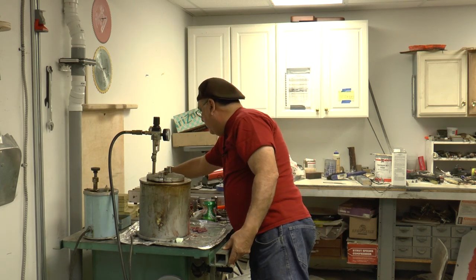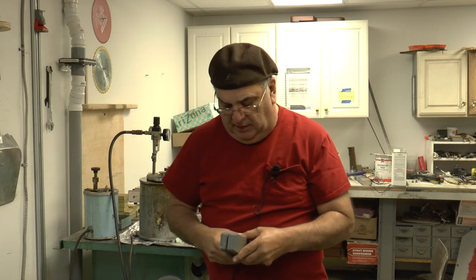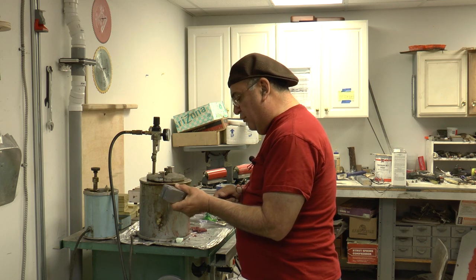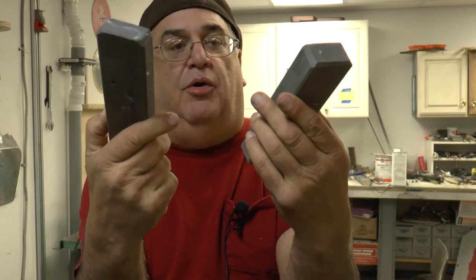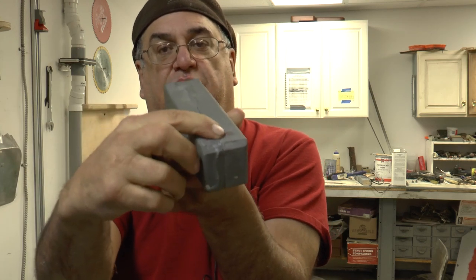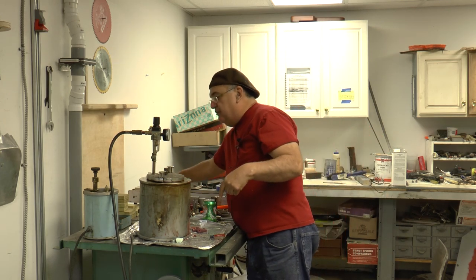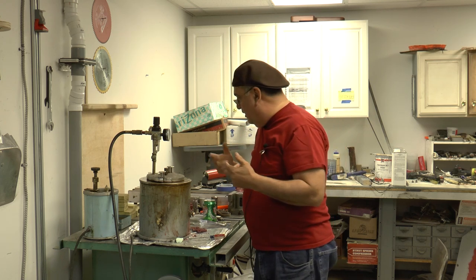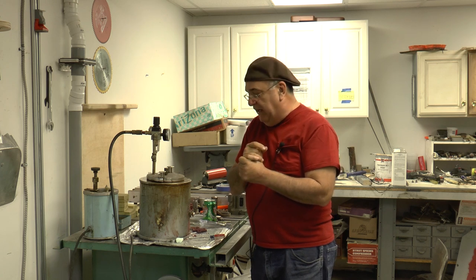And to make that, I used an epoxy mold, which is just made out of urethane. Same stuff I used, the Repro, is BCC Products Repro, that I used to make my submasters. And there's that. And that's a mold, and you shoot the wax, you put it together, clamp it with a clamp so it doesn't shoot out of the thing here, and you shoot the wax in there. You can't make them repetitively over and over real quick, because the epoxy mold heats up and then it won't work. With the aluminum, it dissipates some of the heat of the wax through the aluminum, and you can make them a lot faster. So that's the one major advantage of that.